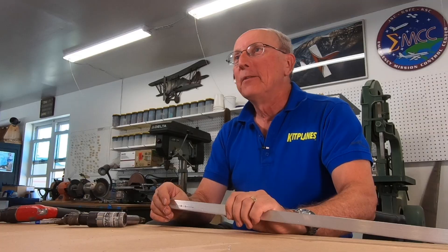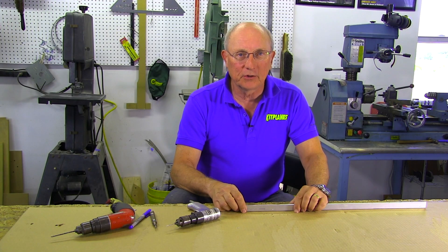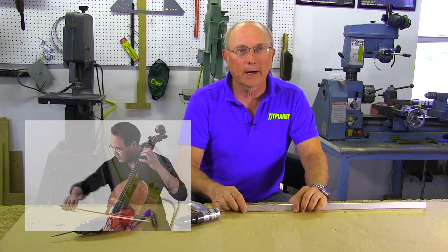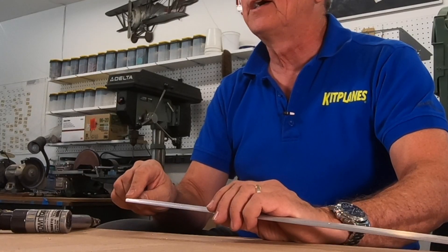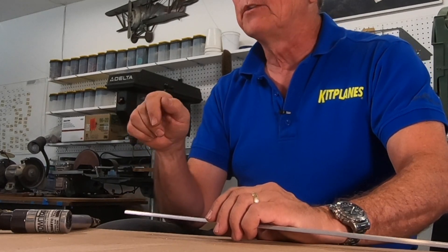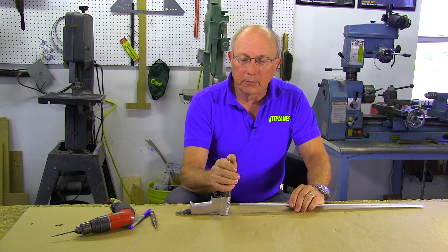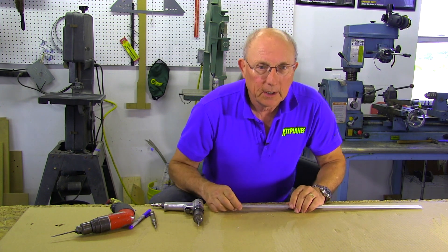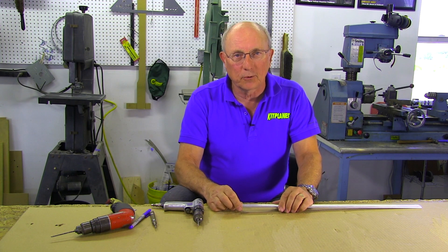You're going to do a lot of it, therefore you want to practice. Almost every metal airplane kit will come with some scrap material — if it doesn't, buy some scrap material, it's not expensive — and practice. Practice getting your hole going exactly where you want it, starting it so that it's right on your straight line, and make sure that you're crawling through and not melting your way through. You'll be able to tell if you're melting through because you'll end up clogging your drill bit with melted aluminum. Practice until you've drilled 100 holes before you start drilling holes in your actual metal parts.